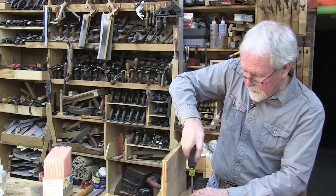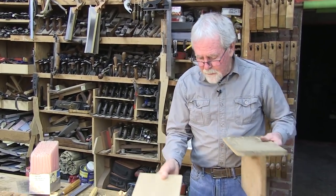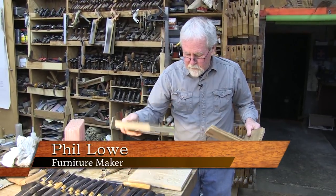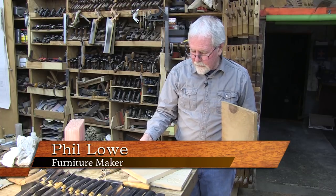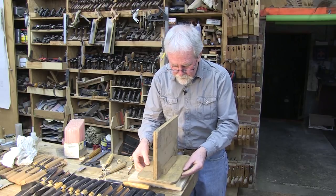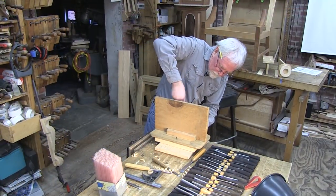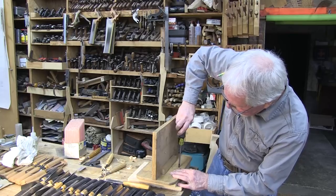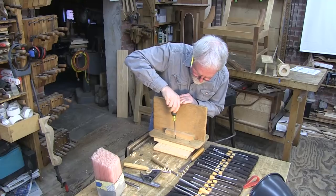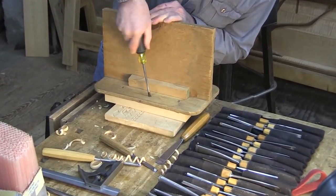I held this to the board with a couple of sheetrock screws. You could use double-stick tape as well, but you certainly don't want to screw it in if the surface is going to be visible. Since this is just an exercise, I'm going to go ahead and screw this down. Basswood is so soft it doesn't take much — just a regular screwdriver. With a harder wood you'd probably need to drill pilot holes so that you don't break the screw off.